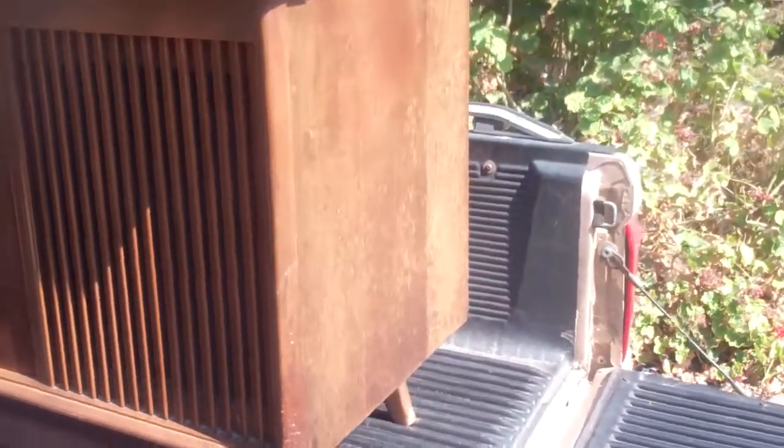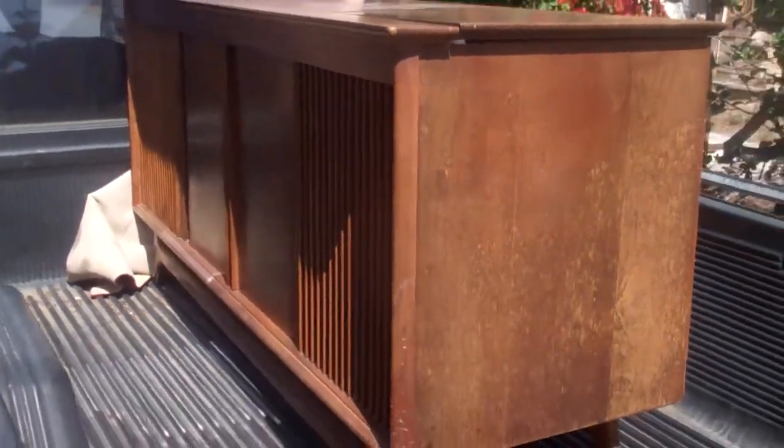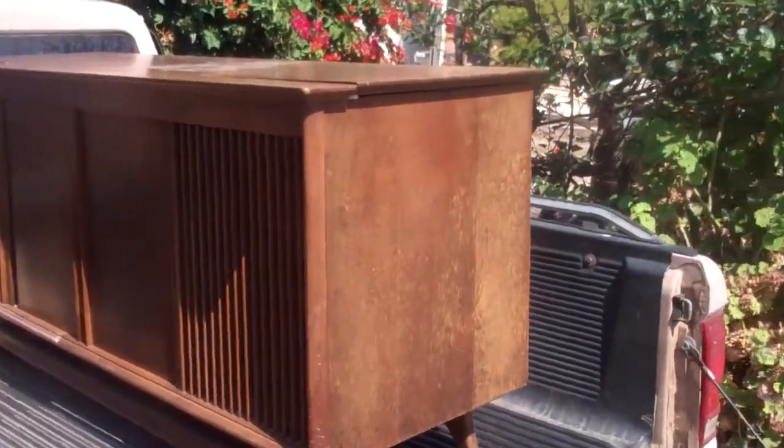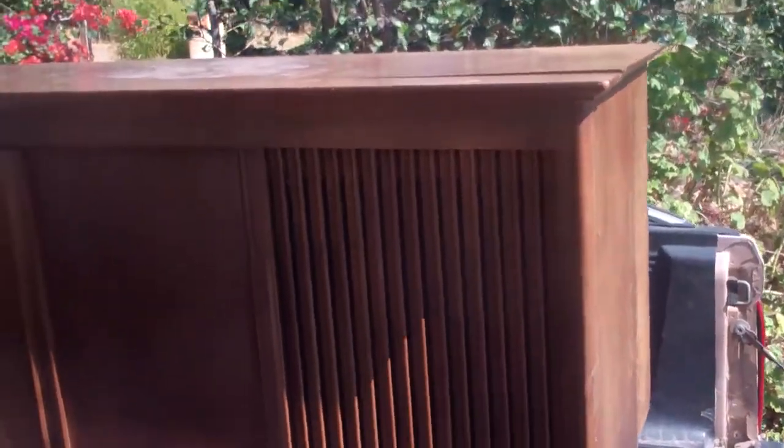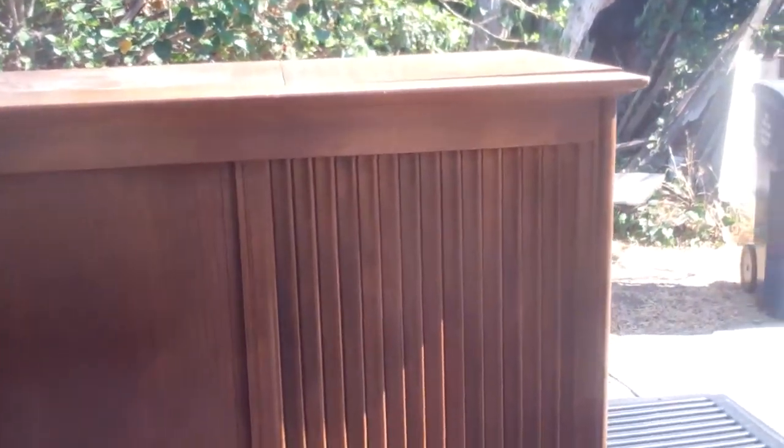Here's the Packard Bell 98 C8 chassis combo unit. You guys will remember this — I did a house call and put a new cartridge in the turntable, lubricated the turntable and the pots in the tuner section, replaced the horizontal output tube, and adjusted the cathode current.